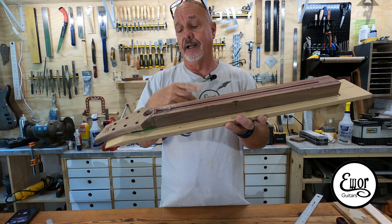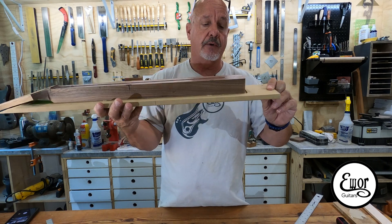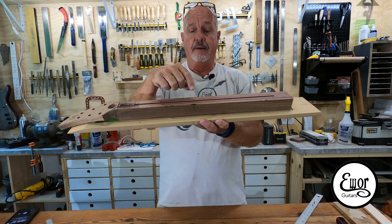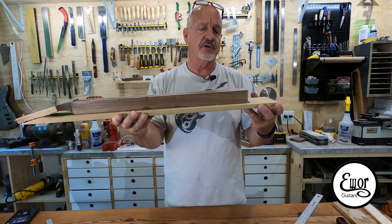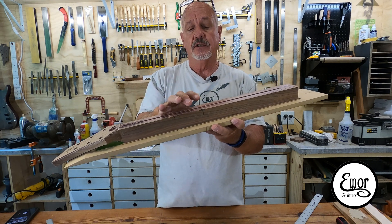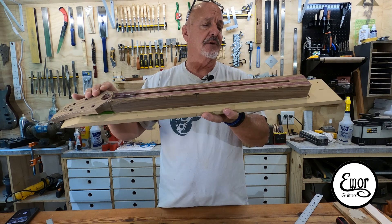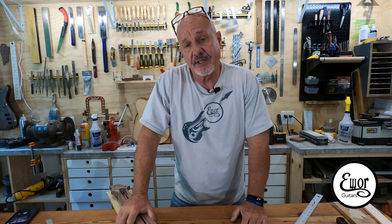There's one last thing I want to do — I need to resurface the top a couple of times because it burned really badly in one spot and I don't want to see that under the fingerboard. I still have the base plate the neck was attached to from yesterday, and the CNC machine cut a slight slot into it, which allows me to precisely re-align the neck exactly as it was. I can run the surfacing tool path again, taking a thousandths of an inch at a time, to get that burn mark gone and hit right on the nut line. That'll be it for this week — I hope somebody learned something, especially about keeping your bit sticking out far enough from the collet. God bless and we'll see you in the next one.